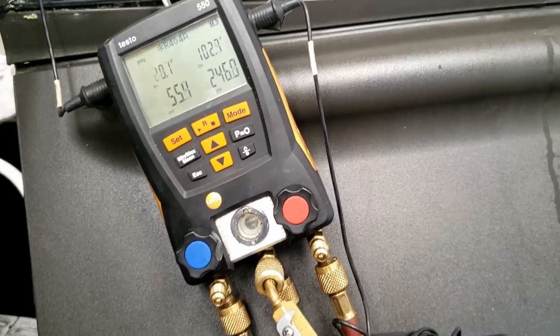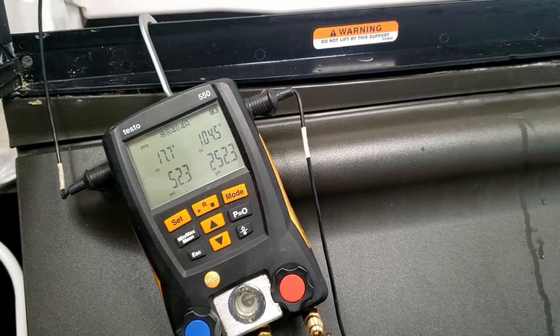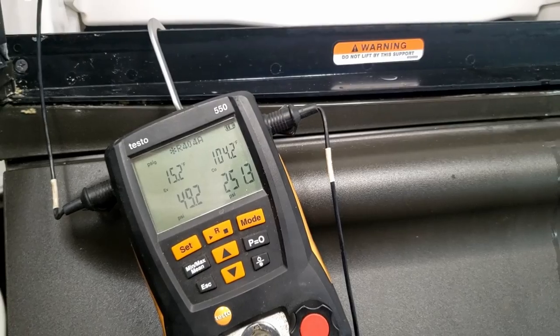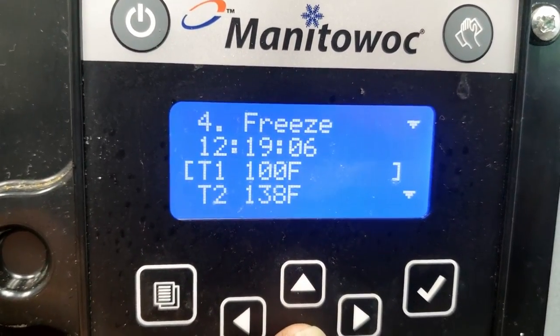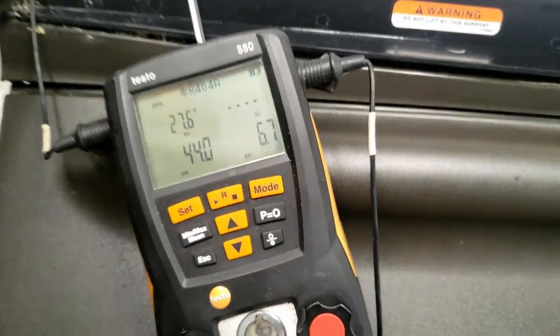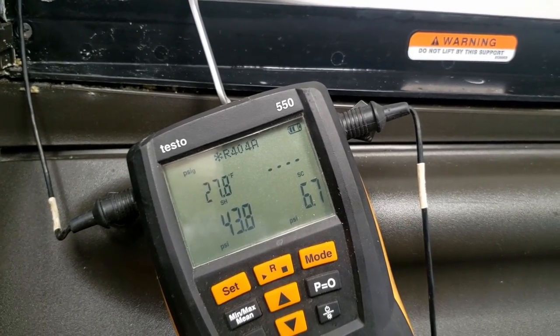We're gonna need to come back and probably do an extensive leak search, depending on whether the customer wants to or not. Just watching it — I'm going to thicken the ice up a little bit, I think it's not quite heavy enough to drop correctly. Cleaning is key to a nice slippery coil to watch your ice fall off. So we're running 100 degree liquid, extracting about 38 degrees of heat, and our Delta T between in and out on the evaporator plates is five. Running about a 27 degree superheat, which seems a little high but it's feeding pretty good and freezing fairly decent.